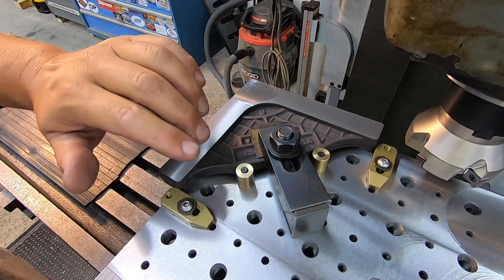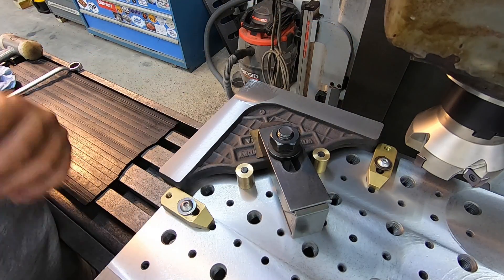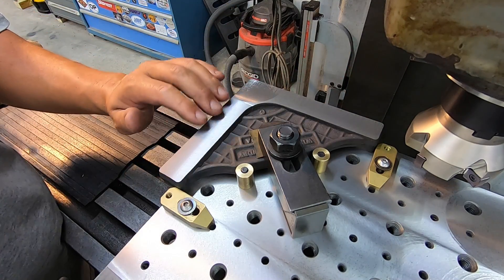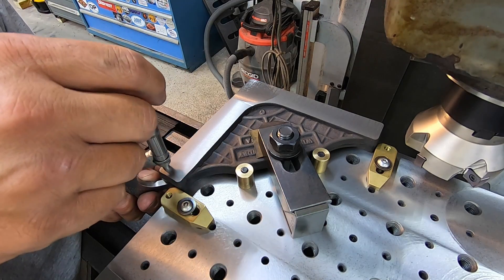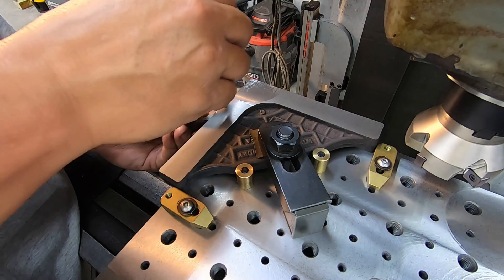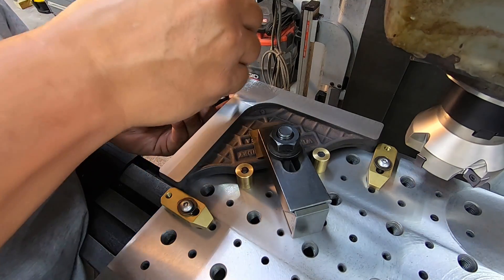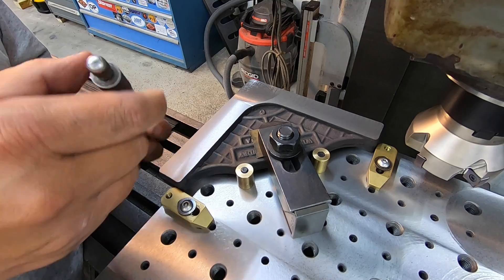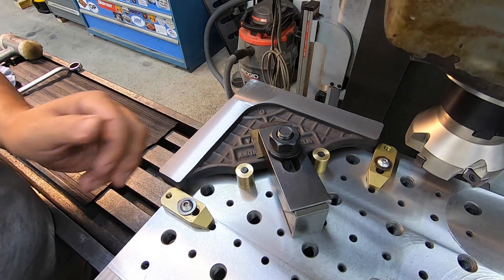This is my square — the one I wrote my name on, the one I was given first. I've got everything pretty well where I want it. I went ahead and cut both sides — a total of ten thousandths off, five thousandths off one side and five off the other — and now we're getting it nice and even. I'm actually six thousandths under three-quarter because I had to clean it up, but I'm getting a good consistent reading all the way down, so we know we're cutting nice and straight.